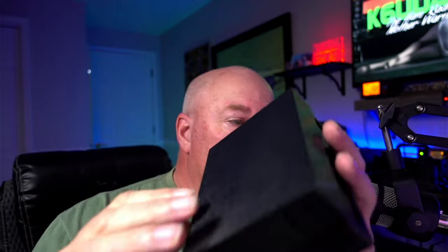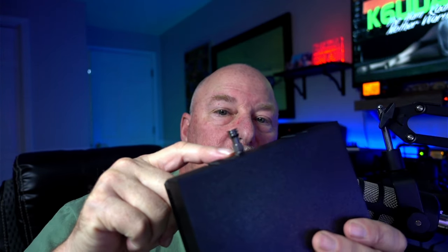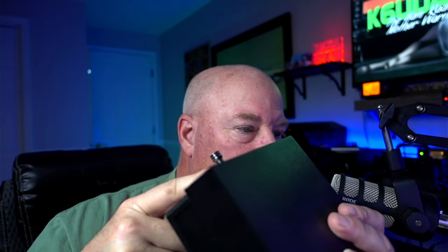When you're dialing around on either the DMX-40 or your external radio, you can use the zero beat of the signal to figure out if it's strong enough, and then use the RIT on either radio to get your 1300 hertz. The radio also comes with a nice little cover for the screen. If you're going to run in external mode, get a small little dummy load — these are on Amazon for like five bucks.